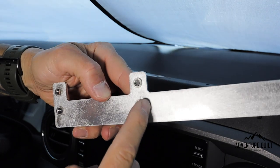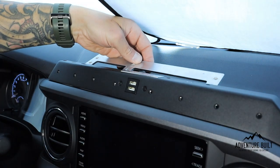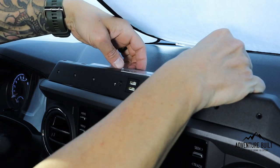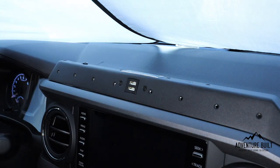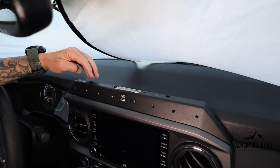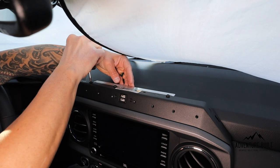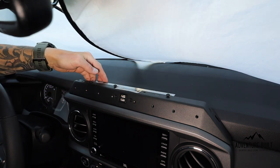The plate has two sides — one is flat and the other is tapped. We're going to use it with the flat side facing up, placing it so it goes into the second, third, and fifth unused holes. Place it on here and put the screws in finger tight, keeping it loose. Snug one down to give it some rigidity while still being able to loosen and move it if needed.